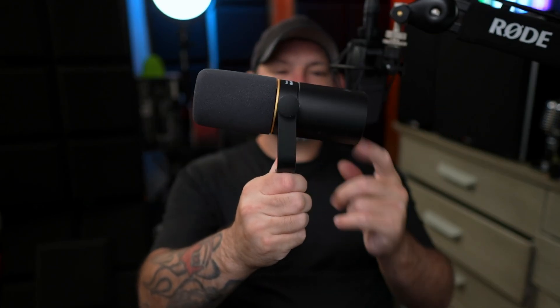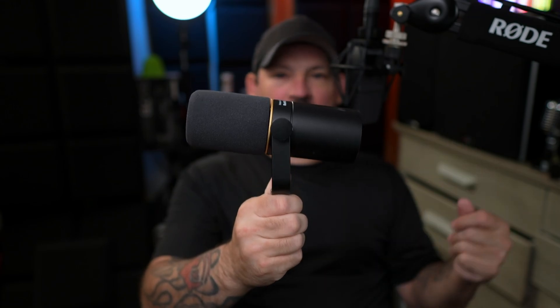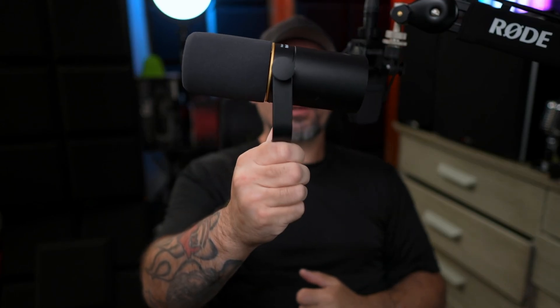Now there are a few exceptions out there and there are some USB microphones that sound really good, so USB microphones are not necessarily bad. But even the ones that have both XLR and USB almost always sound better when running on XLR — unless you're running something like one of the newer Rode microphones with those really high quality Evolution or Revolution preamps built in. Generally the preamp, headphone amplifiers, and digital-to-analog converters built inside these little USB microphones are not as good, so they generally do not sound as good as an XLR microphone.